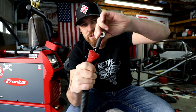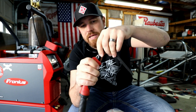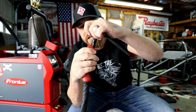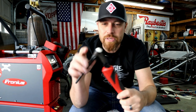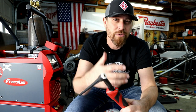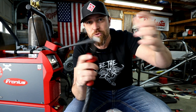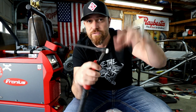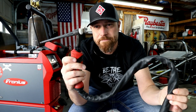It has all kinds of features. You've got a swivel head so you can swivel it 180 degrees. It's actually got a head that can be unplugged and plugged back in — ready to go. The advantage to that is say you had an aluminum setup or a stainless setup, you could have two separate torch heads set up for two different processes. You literally just pop it out, pop a new one in. You could also have lengthened torch heads if you needed to reach a place you couldn't reach with a normal TIG torch head.